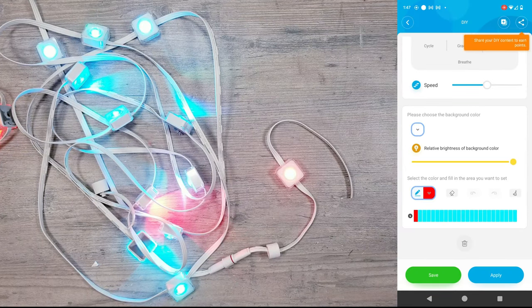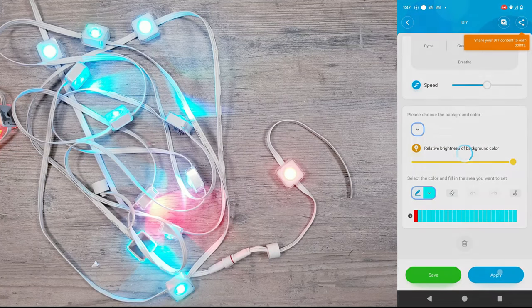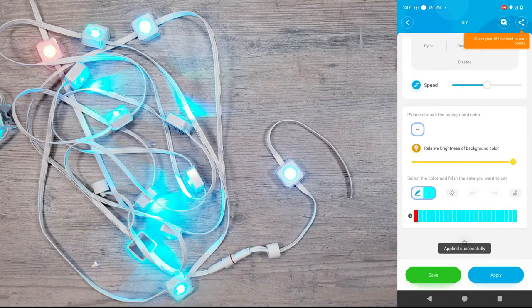So at least for my testing, you can certainly cut off as many or as few lights on a strip as needed, since more than likely the end of your install is not going to line up perfectly with the end of a complete strip. However, the app will still operate as if those lights are still there, but for the vast majority of all animations and effects, you would never be able to tell the difference.